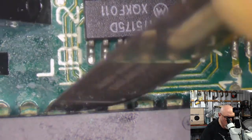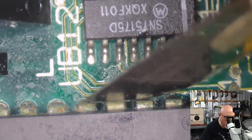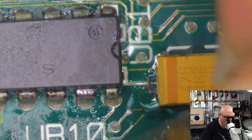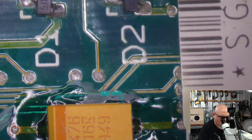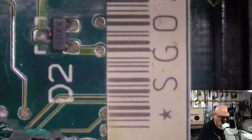Yes, this is true. I did have some green up here on the sound chips, these guys here. And sound chips can often be the cause of problems on these things, there's no doubt about that. Having said that, this is just surface green. I don't think there's any problem with what's under it. And it wouldn't explain why it worked until the customer recapped it. That suggests to me more that something got damaged in the region of one of the caps. That one was okay. I remember having a good old look at that one. That's all fine. We have these little areas of blackening here, but there's still copper under them, so I don't think they're actually breaking in there. No breaks, no breaks.